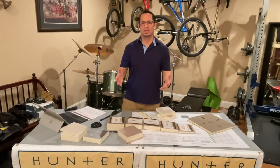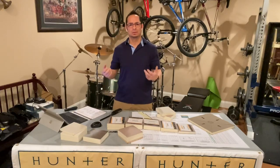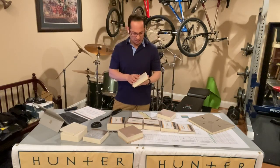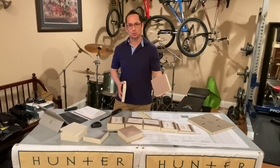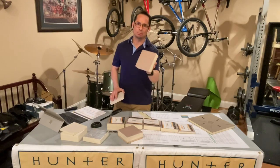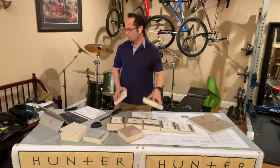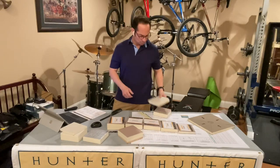Another reason to have coated glass facer is if you have new construction, structural concrete decks, lightweight concrete decks, you still have some moisture in there. Remember, coated glass facer is not going to be affected like a paper facer would whenever you have moisture. Whenever this gets wet, it's going to cup, it's going to bow, and then you'll get some microbial growth on it. Coated glass facer doesn't have those types of problems.